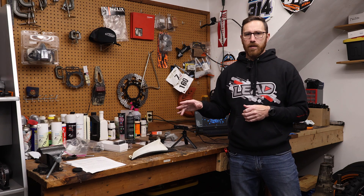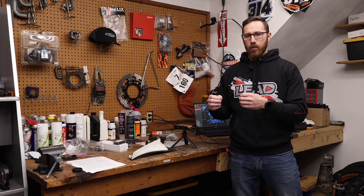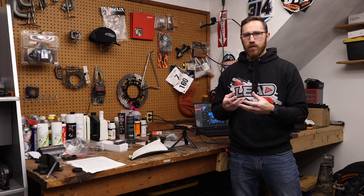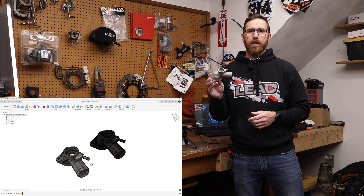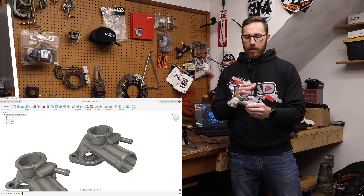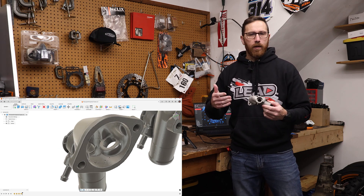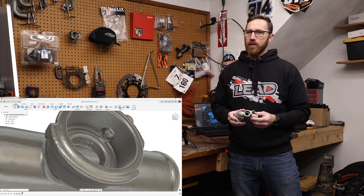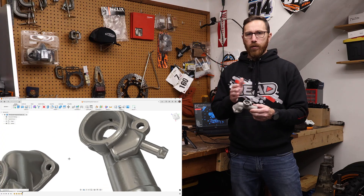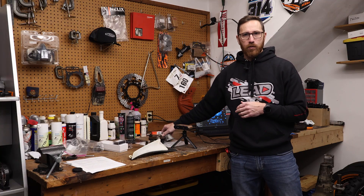Beyond the filters and mobile kit, I would say this is a really solid offering for someone getting started or looking to add a laser scanner for smaller objects. When I say smaller objects, I don't mean pulling details from tiny coins — but scanning this thermostat housing, for example, is a perfect use case for the parallel laser line mode. It has 11 parallel lines and pulls in about 85 frames per second on my computer. By comparison, a Metro Y or Metro X runs 40–60 fps but pulls in far more points per frame. So while the frame rate is higher here, it's not pulling in more total points than those higher-end scanners.